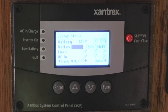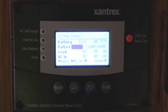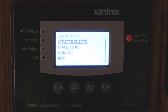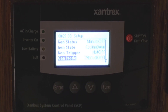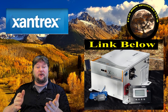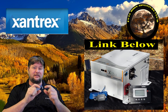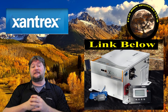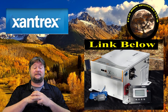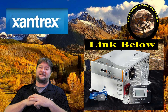So all in all, a really great display. It also has all these soft key functions — easy start on the display here at the bottom. By using the Function button, you can cycle between them and then use the up and down arrows to start your generator, start and stop the charger, the inverter, anything you want. Really great display and I've really enjoyed using it — it's very easy to use. I hope you remember that tip about hitting Enter and the up and down arrows at the same time to open up the advanced menu; that's really only mentioned once in the manual in a small section. Loving this so far — once you get yours installed, you're going to have absolutely no problem setting it for any kind of battery bank. This is a very versatile system. My name is Jim with Full Moon Adventure Club, and until the next video, thank you so much for watching and happy camping.